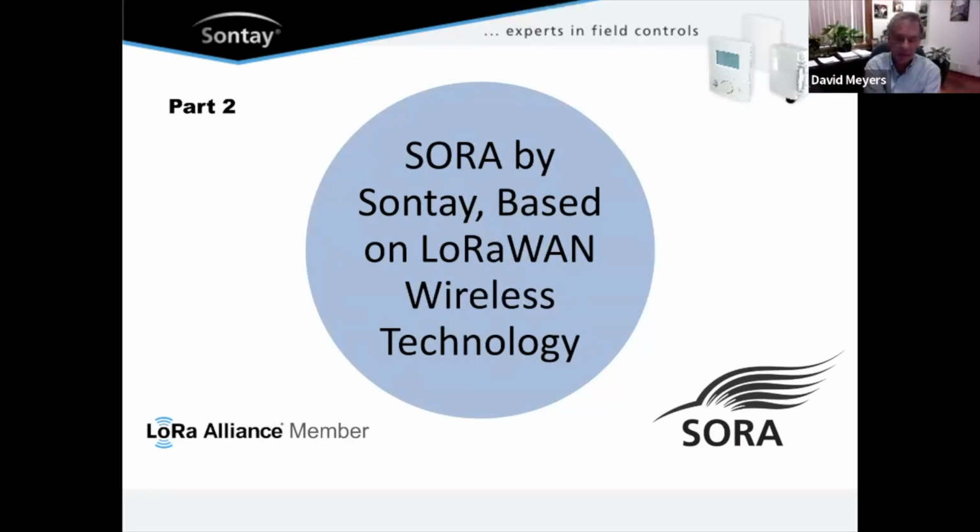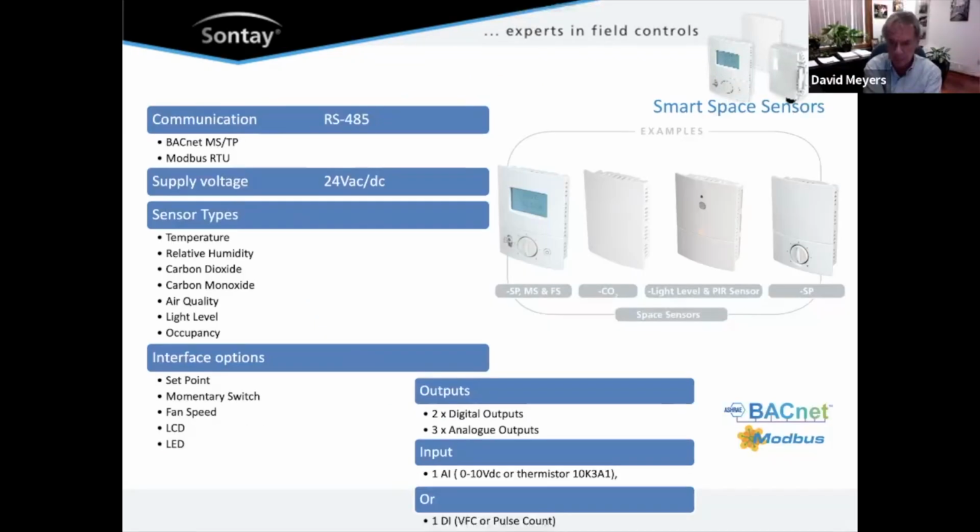Sure. The highlights of the product are, of course, the 7 multiple sensors under one hood, the significant reduction in wiring cost, and significant reduction in I/O points onto your building automation system, whatever brand you're using. And this sensor is not a controller; it's just a sensor. So you're doing all the controlling in your native product that you're a dealer for, a rep for. And you're just using this product as a collection point of the data and an output base for some of the output to save you I/O on your module. And then I think the push button and the diagnostic features under the hood are important also.